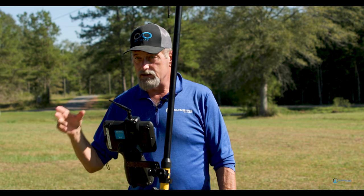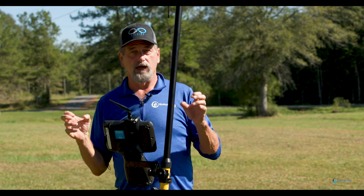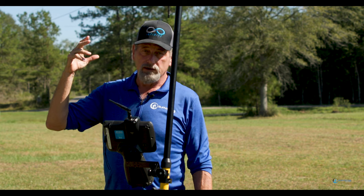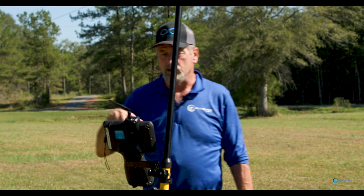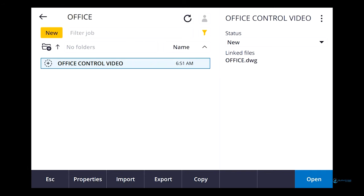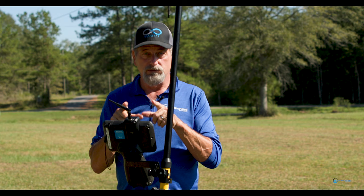So what we want to do is, I've ended the survey. So what I want to do is I want to be able to use this as a base, but I want to keep my projection, right? So I've set this point, I've come back tomorrow, or next week or next month or whatever. Now I need to get back on this projection, this calibration, localization without having to do it again. So what you're going to do is, I'm going to go into this job and look at the properties, and you're going to see it says Mississippi East 2301 site. I need to be able to copy that and to be able to use it again.